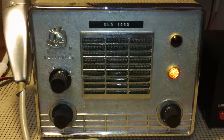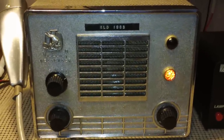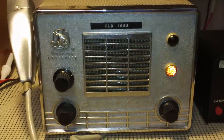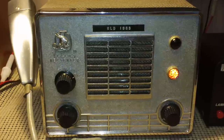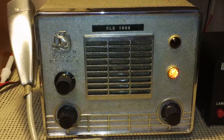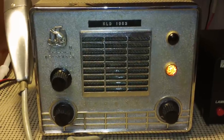This radio does not work on DC — apparently the vibrator is bad. In the second video, I'm running off of a bunch of alligator clip leads. I don't have the nine-pin octal socket needed to make a real power cord up for it, and the DC cord I have for these is missing the pins I need to make it AC. Another one of those make-do-with-what-I've-got type deals.